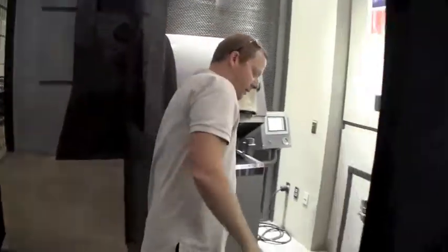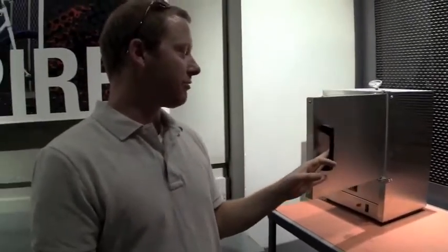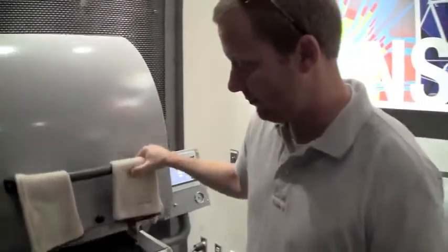What we're going to do right now is we have the parts preheated in the oven. In here it's just a standard convection oven. The parts preheat for about four or five minutes to open up the pores. Then we'll put them in this vacuum former which is going to vacuum form the film around them.